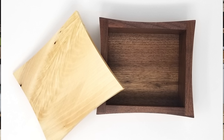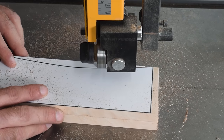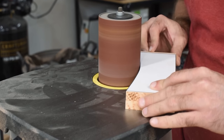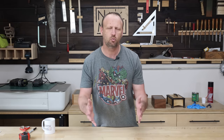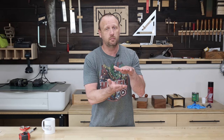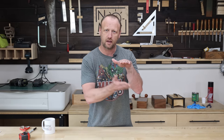I mentioned shape whenever I listed those fundamental tenets of your box. Most of the time, that shape may just be square or rectangle. If you want tapers or some sort of pillowy effect or curves, those are all things you have to consider right off the bat because they're going to affect the dimensions of your piece. Let's say you want a box but you have a cool curve along the bottom — you have to take that into consideration now, because that means you're going to make your box a little bit taller than normal to account for that curve.